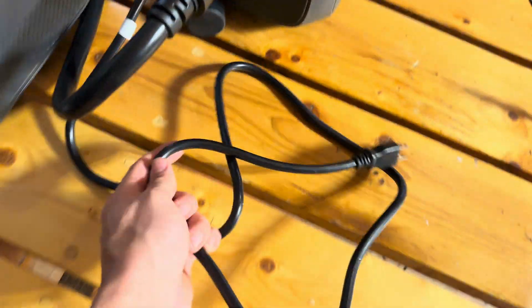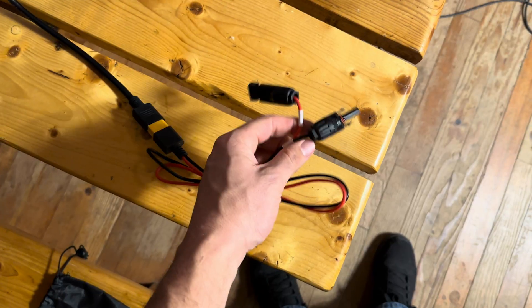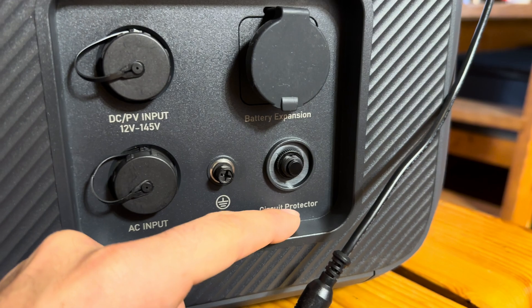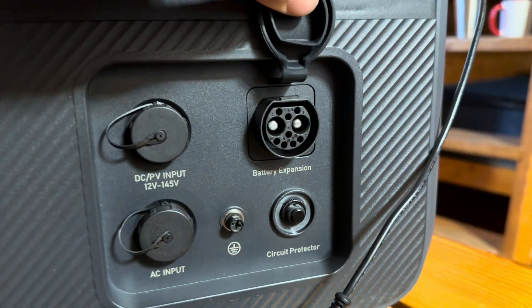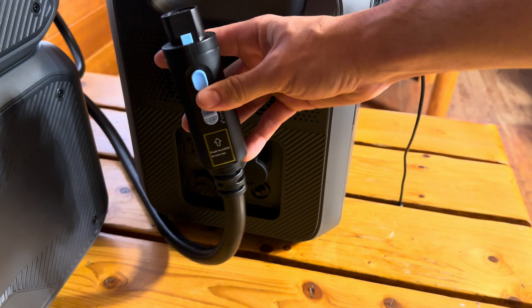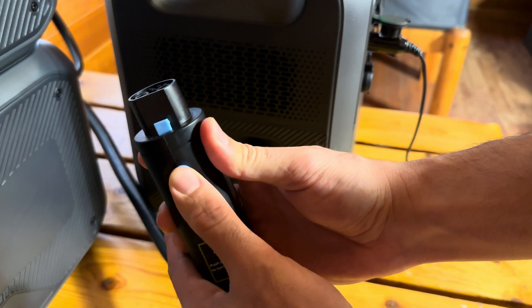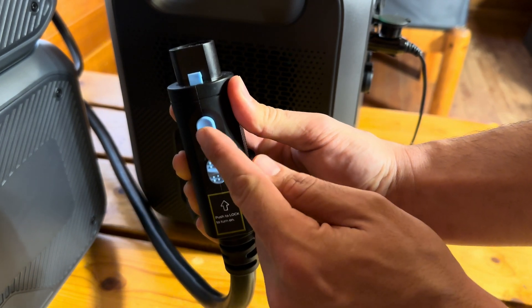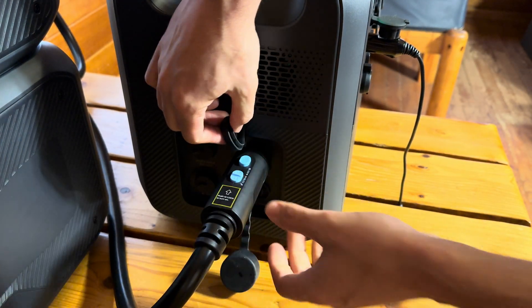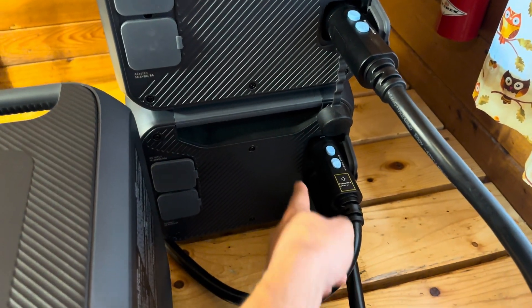Here's the AC cord connected and the DC cord connected — it just screws right in. You can see it connected to the cigarette plug and to the MC4s for solar panels. There's also a spot to ground it with a little screw, a circuit protector, and this is where you do your battery expansion — I have two B300s plugged in. To connect the expansion cord, there's a push button and a lock/unlock mechanism. Make sure it's in unlock, push the cord into the expansion slot, then lock it — now it's safe and secure.